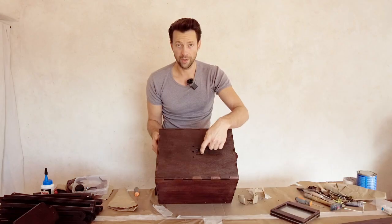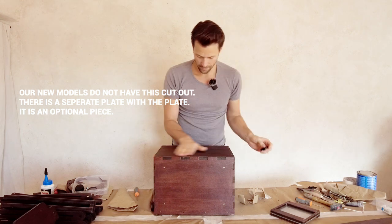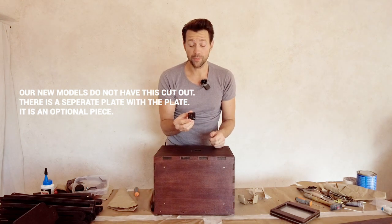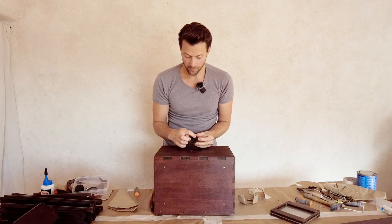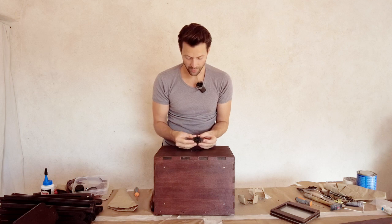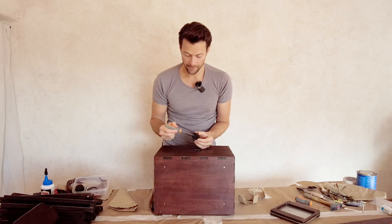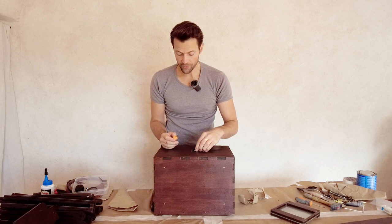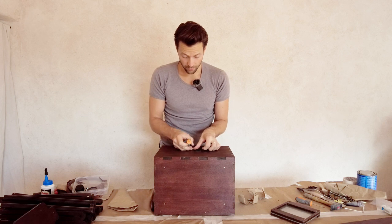On the bottom of the box is the large area for the tripod plate. We'll put it in with those markings facing downwards — upwards in our case. We can place two screws here. You can also glue it in with super glue or any other glue. I'm going to use a two-component epoxy glue today.